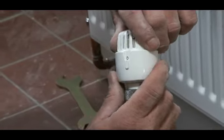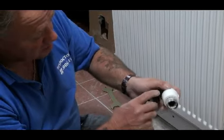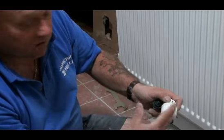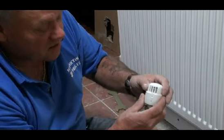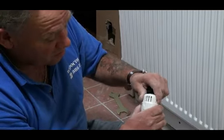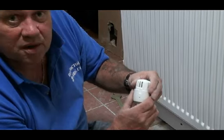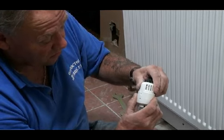Look for one that goes down to zero and then you can be sure that the thermostat section has depressed the plunger right to the bottom and turned the valve off. People don't realize that a thermostatic radiator valve isn't operated by the temperature of the water — it's operated by the temperature of the room. If that room decides it's going to be a bit cold, the valve senses that and opens up to warm the radiator depending on the setting you've put it on.